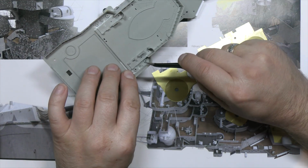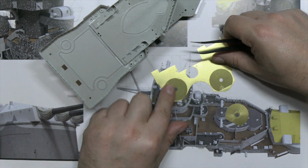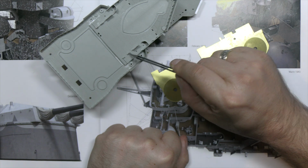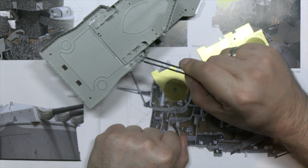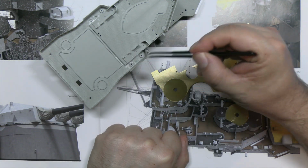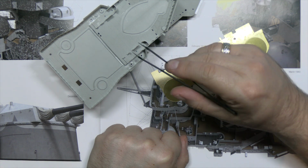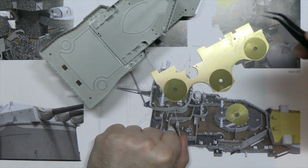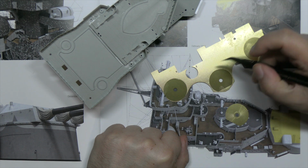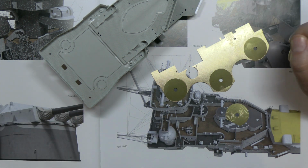getting a plastic deck in there that is fitting and is correct. So we're going to cut a thin piece of deck to fit, and then we're going to put some support underneath and build it up so we can lay it on the top, and then when we're happy that that all sits flat, we can use that as a template to cut the steel deck out, is the plan. So let's see how we get on.